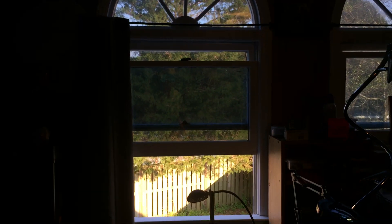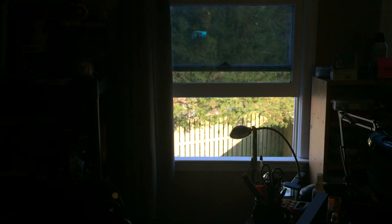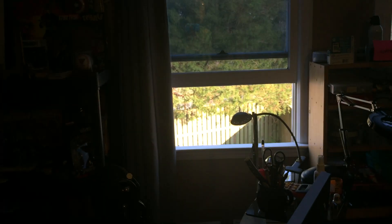It's a pretty easy process. It's a roll of film with a backing — you peel that off and it's got one sticky side and one non-sticky side, and also a mirror side, which faces out toward the light. I just treated these windows in the last few days. You can tell the difference even from standing back. If you've ever seen a limousine go by and you can't see the people inside — that's kind of what's going on here. The outside is a mirror finish and the inside is like wearing sunglasses.